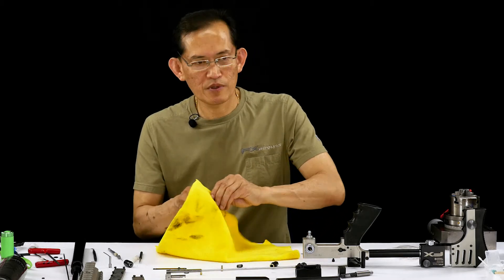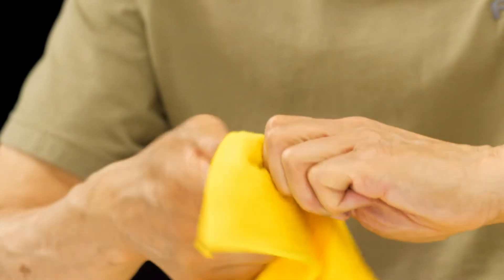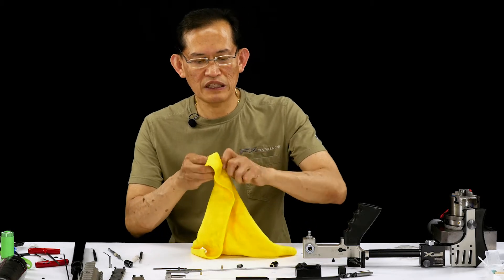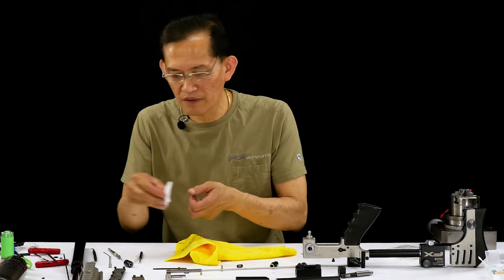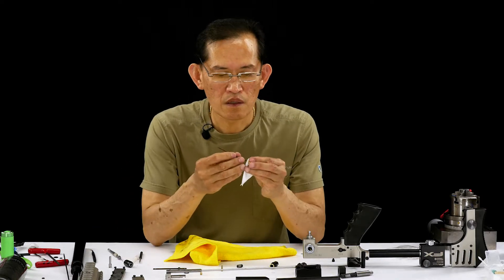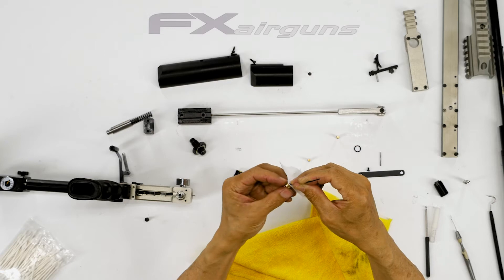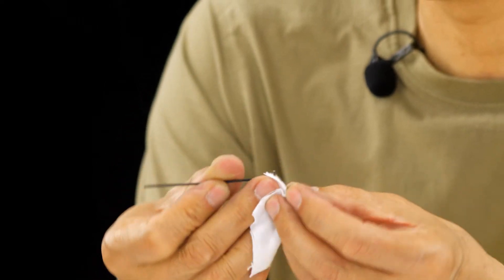Clean this piece out. Remember the o-ring sealing surface. There's gunk between the threads. Now we need wipes to clean inside the bore and o-ring groove. I'm actually inside the o-ring groove with the wiping, rotating it. Make sure you get the whole o-ring groove clean.